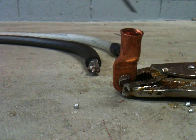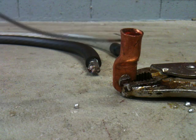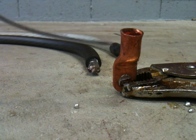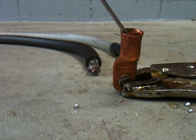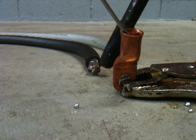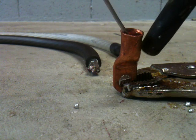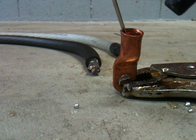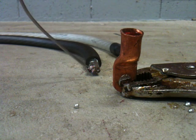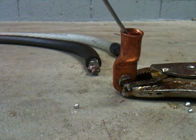I've taken my gauge end right there and stripped it, and it's ready to go. I fill this crimp up about halfway and by the time I'm done it's going to be a flaming volcano mess, so I'll just blow it out and then as quickly and methodically as I can, just make sure that I get all the ends inside there and squeeze it in. Sometimes you'll have a little bit of solder flow out, sometimes it'll go in perfectly, but if it's nice and hot the solder will actually creep right up the wire as you're inserting it.